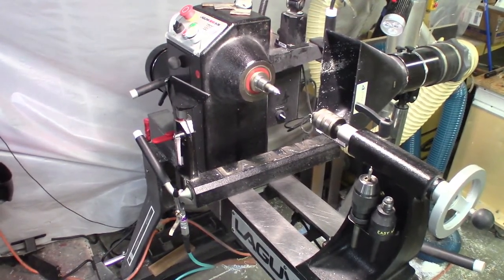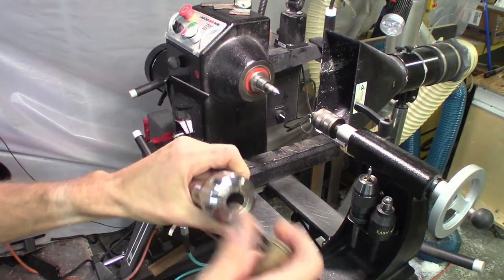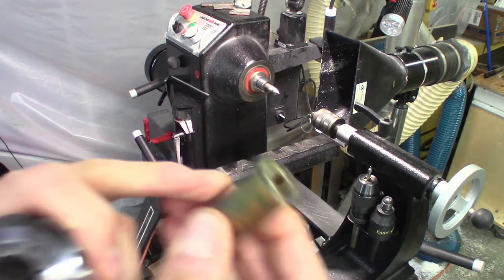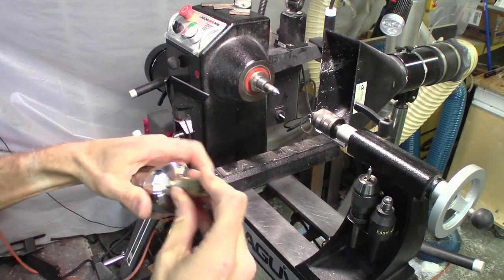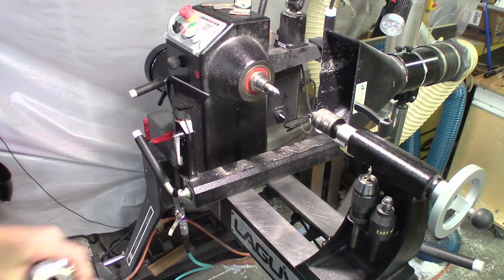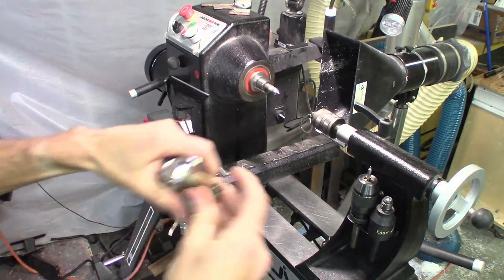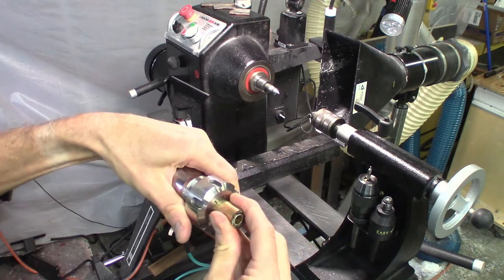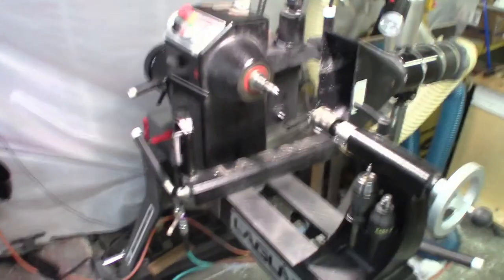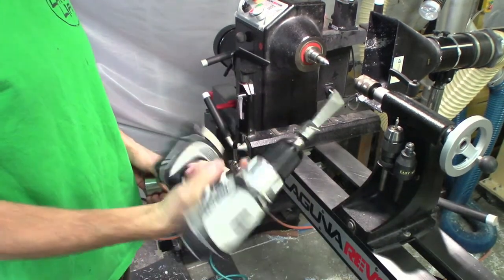All right, so a simple, easy way to do this, and I mentioned this last time when people were asking: just grab yourself a collet chuck. You can tell this thing barely has any meat that I even need to take off, so I'm being very careful with these. I'm just going to load this into my collet chuck, and I'm not even mounting the collet chuck, I'm just holding it in my hand, okay? I've got my barrel trimmer and I just use a hand drill.